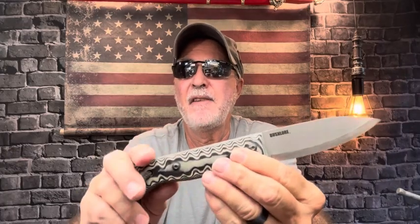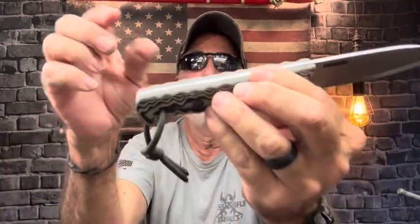So I've now done one, two, three, and four. This one gave me hell today, and Chris knows it because we discussed it. People ask me if I can make a custom form — I'm not ready for that, and this is a perfect example. Condor makes fantastic knives. I took it apart and did a video on it. The wooden scales were epoxied really well. I had to scrape off the wood, sand down the pins to pop them out, and then the brass sleeve for the lanyard came out. The scales were stuck but I finally got them off.